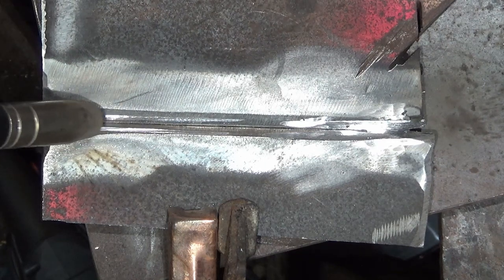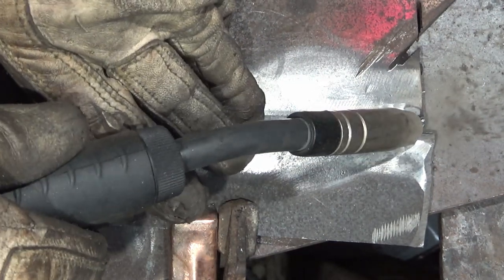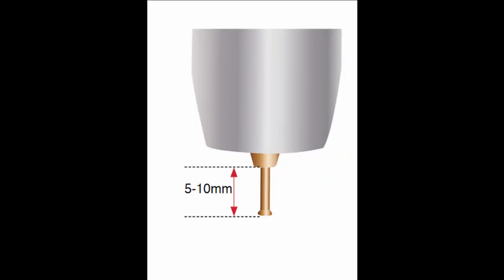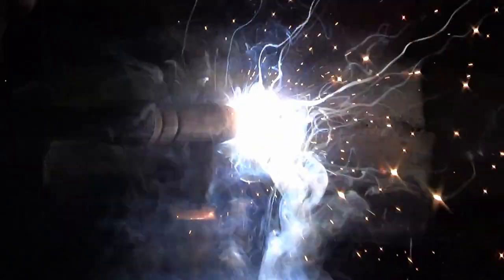Before you weld, make sure you've got three to five millimeters of wire hanging out of the front of your MIG gun. If you've got more than that, cut it off. If you haven't got enough, just shoot a little tiny bit out — that's why you always keep a pair of wire clippers handy. This weld we're practicing is a single bead, single pass. Once you've attempted a weld on one side, flip it over and try again on the other side. Nice, slow, smooth drawback stroke, staying at the same speed and the same angle — take your time, don't rush.